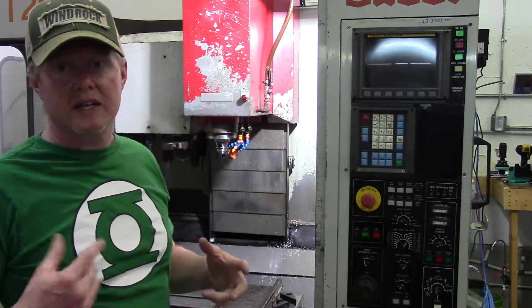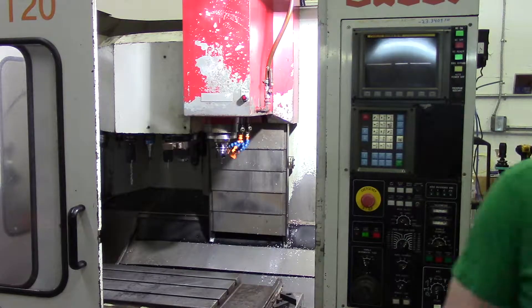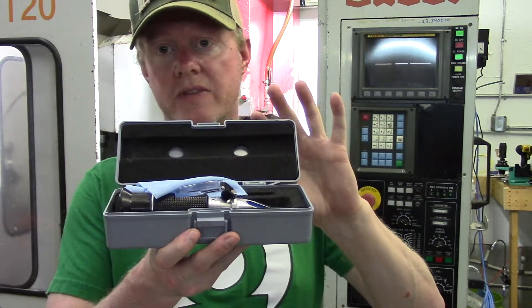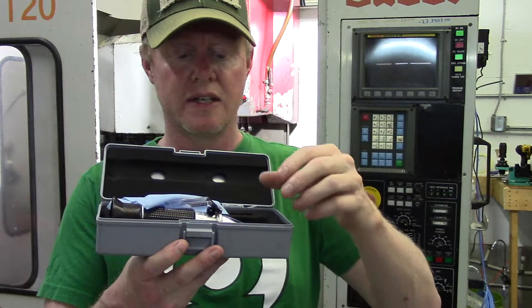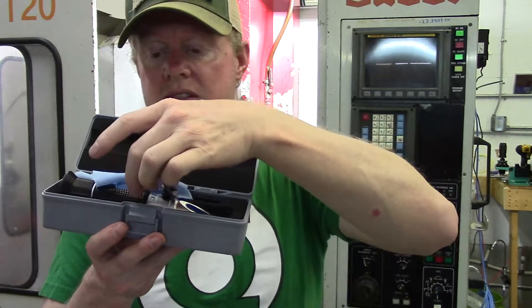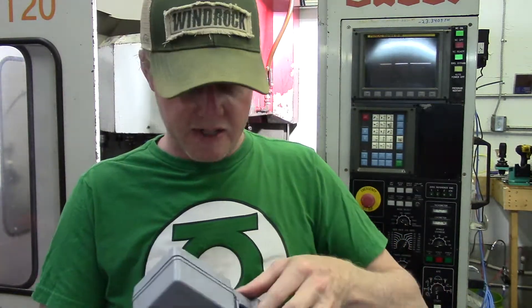You always want to check your coolant concentration. A refractometer is really cheap on eBay or Amazon. To use it, calibrate it against clear water first, then put a couple of drops on the lens — you want enough liquid so that when the cover comes down it presses the water across the whole surface. That'll indicate what your coolant concentration is.